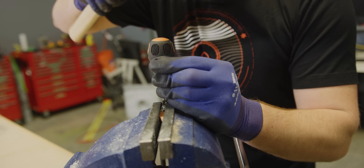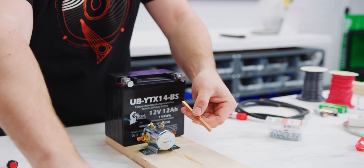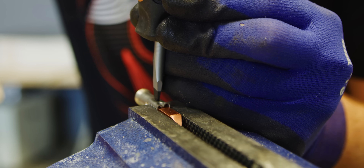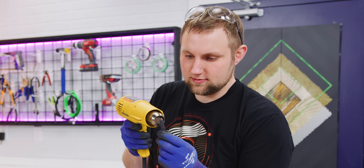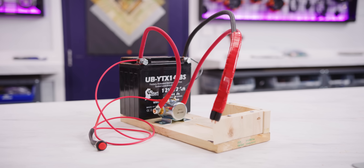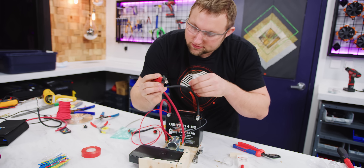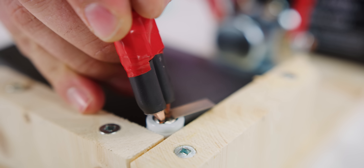With the ring ends crimped onto the cables, the last thing to sort out is the electrodes themselves — but first, some safety stickers from LTTstore.com. We chose to use copper for our electrodes because it's able to both handle the power and high heat at the weld zone while hopefully lasting a reasonably long time. Once we had our two pieces clamped in vice grips, a short trip to the belt sander resulted in nicely pointed ends that should work great for our electrodes. A quick crimp and some heat shrink for safety and the cable assemblies are ready to go. After pairing the electrodes up and some brief troubles getting the fence installed, Colin was able to give the welder its first test run. On that first attempt, he did not get a successful weld — he blew through the strip. But after a little bit of practice, he started getting good, consistent spot welds, more than enough for what we need.